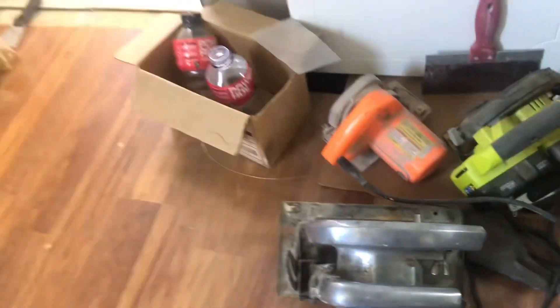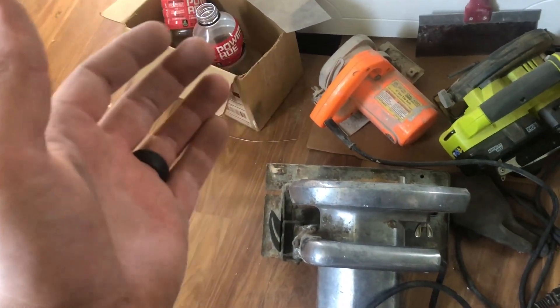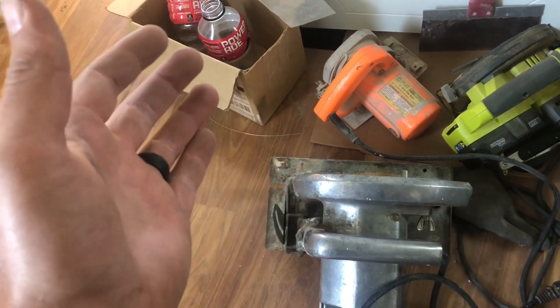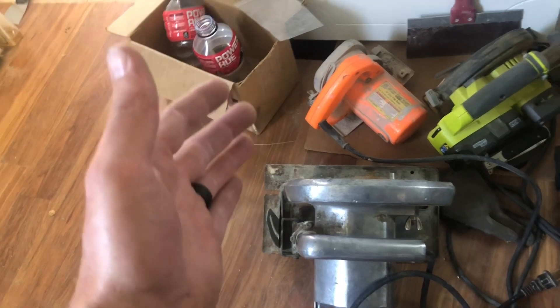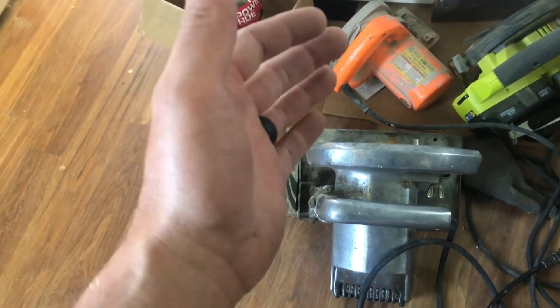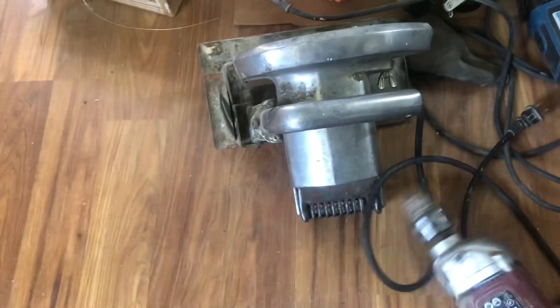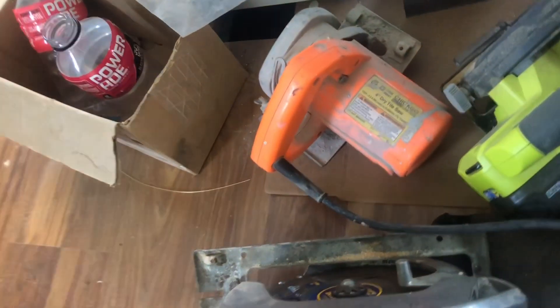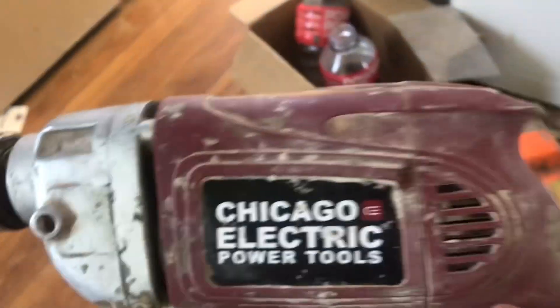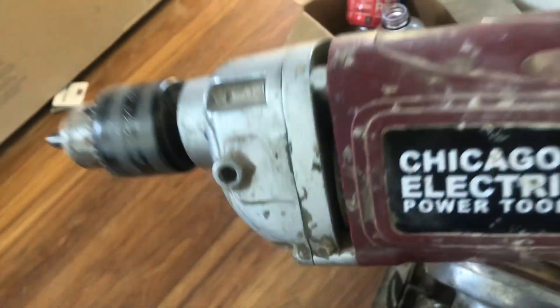That's quite an improvement — you get quite a bit more power. Also, there's more resistance in solid copper wire like I'm using; that's probably why 12 volt applications usually use braided wire because there's less resistance. I'm just using what I had since this is a temporary thing. We can actually run some tests — I'll jump right to the drill because it's the highest amperage tool I have right now. It's a 6.3 amp half-inch Chicago Electric drill and the air conditioner is running on high.